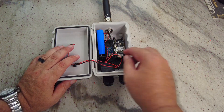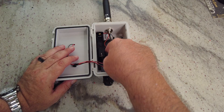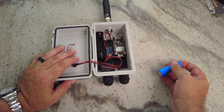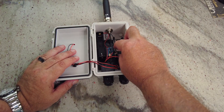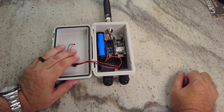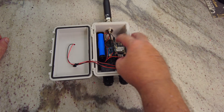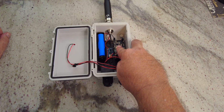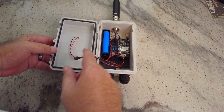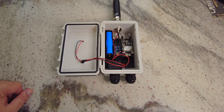Let's get the battery in there. Checking: positive and negative on the battery terminals, output negative and positive going to the WisBlock, and input from the two solar panels — positive and negative. The antenna is connected — you don't want to start this without an antenna on. Inserting the battery and, of course, nothing happens yet since I still need to load software. The charge controller should kick on once it gets a little bit of sun to start the process, so let me take this outside.